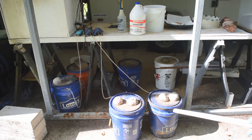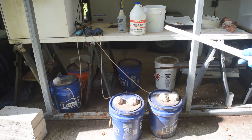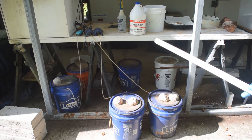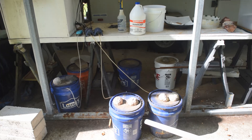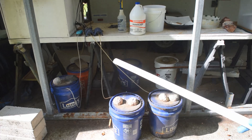The heart of my de-legging system is these two five-gallon buckets. They contain muriatic acid — as the level goes down I just top it off with more muriatic acid, so there's probably close to two gallons in each one at this point. These buckets have been de-legging IC chips for a couple of years now. The liquid inside is very green and very concentrated in copper and tin from de-legging the chips, and iron too since a lot of the legs are steel.